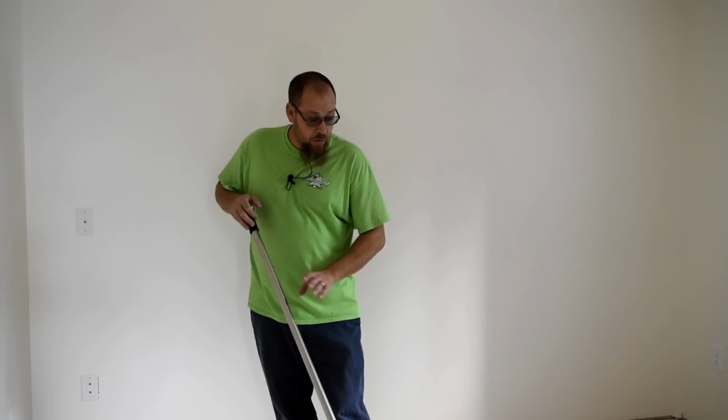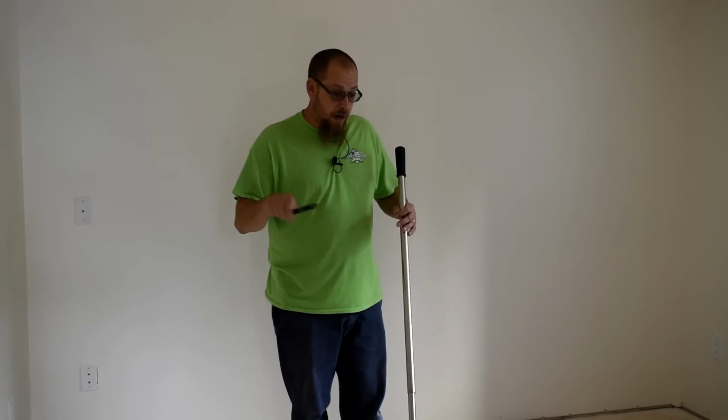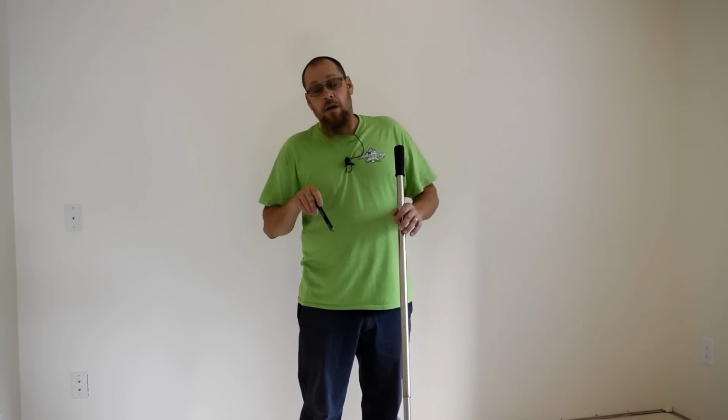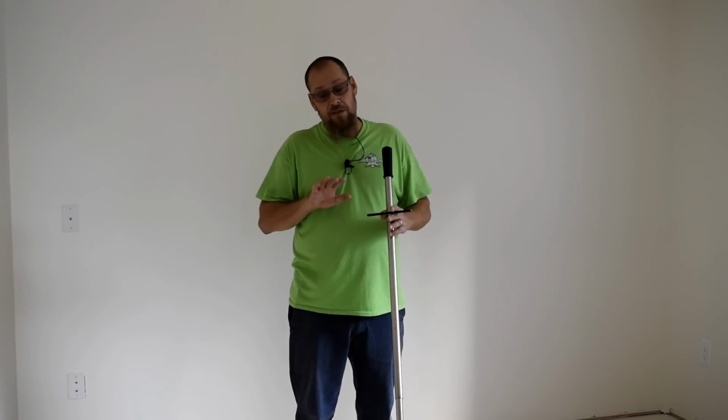While I'm going over the floor, if I hit a nail, I'm going to take my pencil I got right here, and I'm going to circle that nail head. That way I can come back and beat it down. Don't want anything sticking up out of the floor. If it's a little sunk in, that's okay. We don't want anything protruding up.